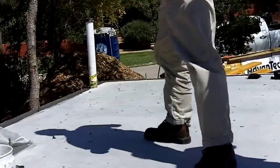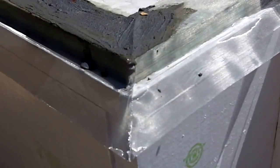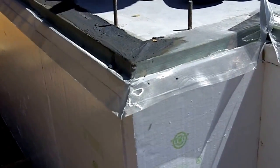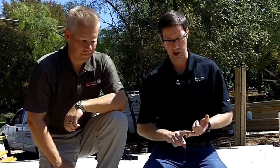If we scroll over here, the guys have gotten about half the slab done already. This is our Termiparge applied on — it's now going through a curing process because it's basically a concrete mortar mix mixed with a glue adhesive. You can see the folds here that we had to do to make it nice and neat in the corner so it holds that corner very well. Really nice work — you guys have done an excellent job on this. We've got two things left to do and this slab is completely insulated and completed: I need to put a protection board on this, and then we have another beauty flashing that we're putting on top of this termite mesh as well — really just for looks, but also for bulk water to really kick off on our sheathing on the outside. Thank you for all your hard work on this, Joel — you and your guys have done a real nice job. We'll be back in the next day or two to show you some further details as we continue this process.